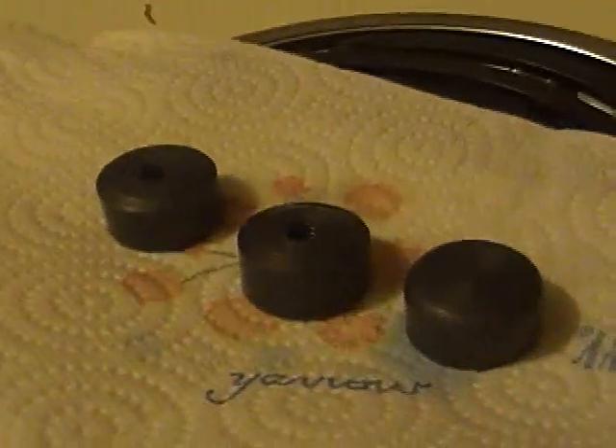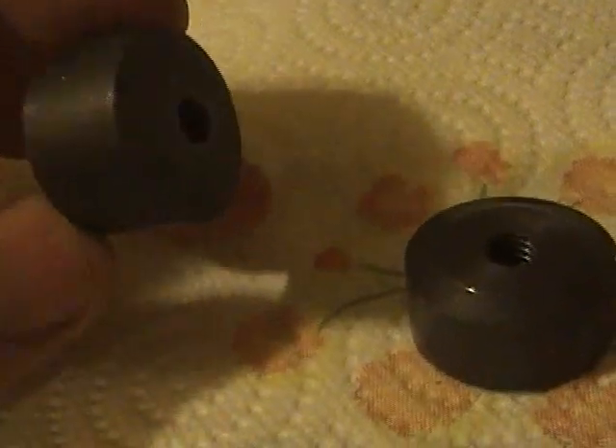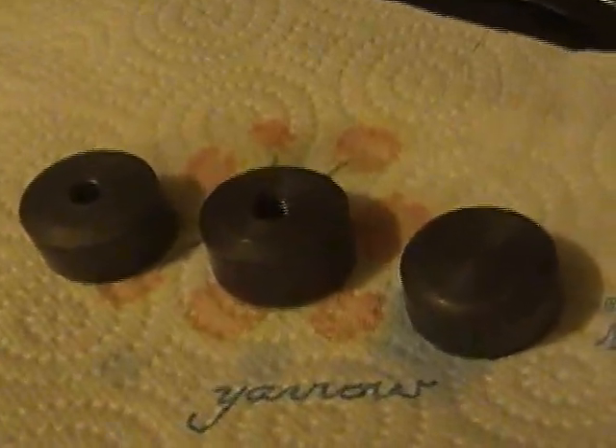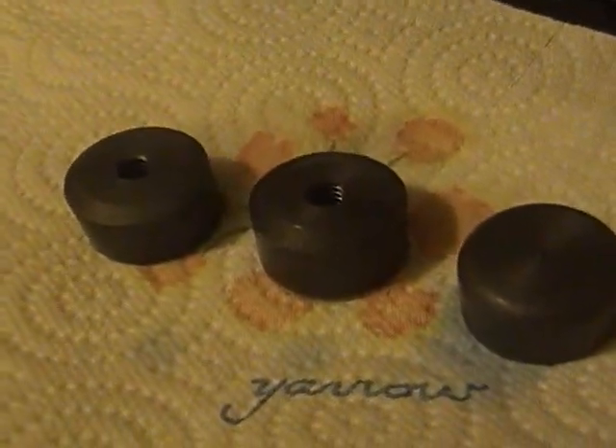Here are the three pieces after they've been in for the full 10 minutes. They came out with a very nice, attractive dark gray color coating — it's called a parkerized finish. Very easy to do at home; you can do it on the kitchen stove. When you're done, you want to coat them with a little bit of motor oil because the parkerizing isn't actually rust preventative on its own — it does a whole lot better if you get a little bit of oil on it.